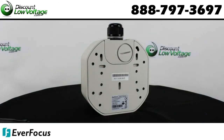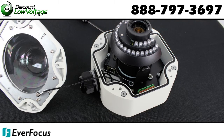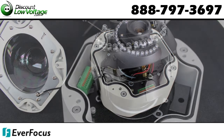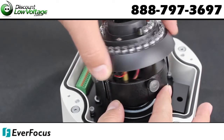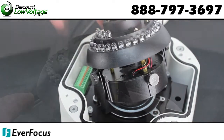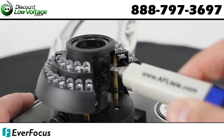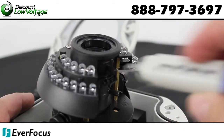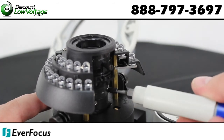Video resolution is 1920 by 1080, frame rate is 1080p at 30 frames per second. Video streaming is multi-stream H.264 and MJPEG. Dual voltage 12 volt and POE. You have 2-way audio with this camera and it also supports micro SDHC for onboard event storage.